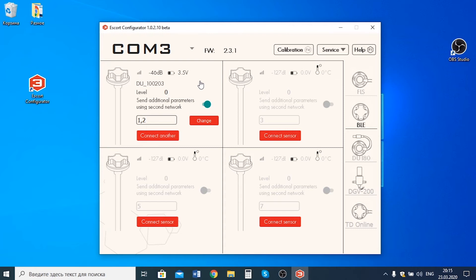You can switch off the transmission of the last two parameters by clicking on this toggle. Also remember that when all four parameters are transmitted, the adapter occupies two separate RS485 network addresses. Therefore, if you are connecting other devices to your GPS tracker via RS485 interface, you need to assign them unique network addresses. Be careful what addresses you use for our adapter and other devices, otherwise you might get an address conflict which will result in corrupted data.